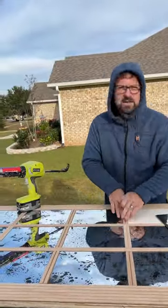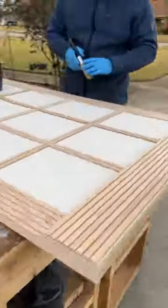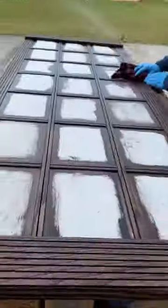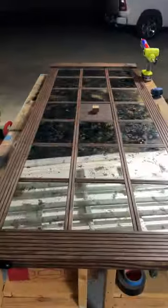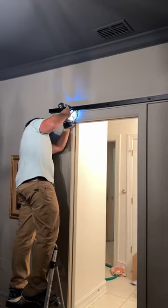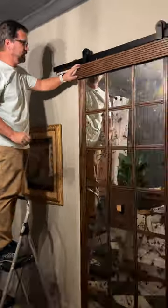From here, the project went smooth as butter. I installed the muntins and then used more pole wrap for the header and footer boards. After that, I applied beautiful Kona gel stain. I glued the mirrors with construction adhesive and then glued a small block where the middle mirror should have been — this was for the door handle I made from a $5 decor item from Dollar Tree Plus. Late at night, I installed the hardware, glued the handle in place, and this antique mirror sliding door was finished and ready for action.